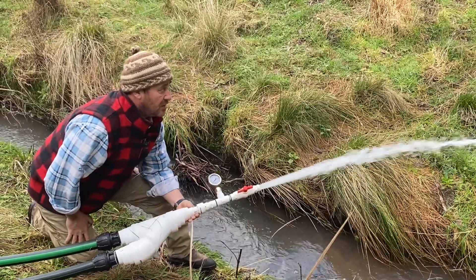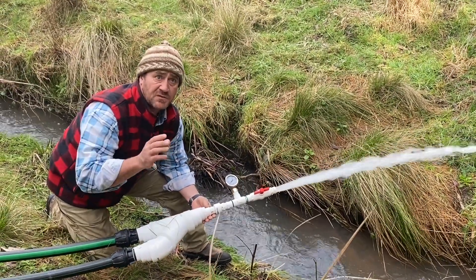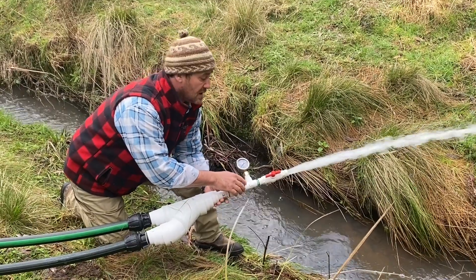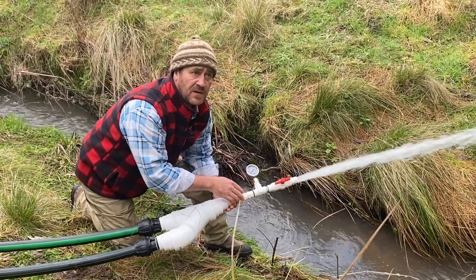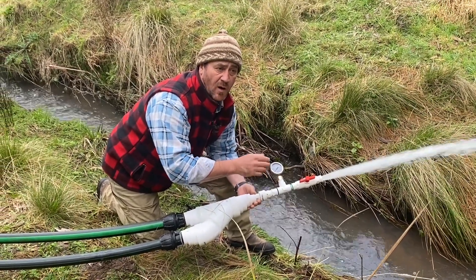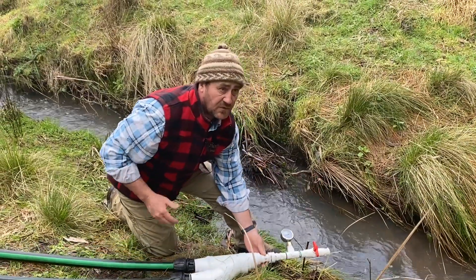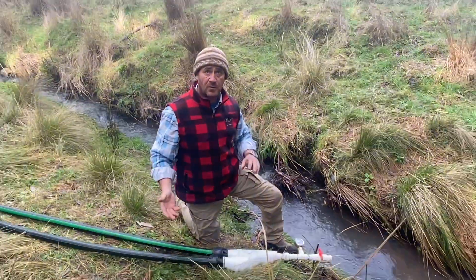You can see I've got my 90mm coming into this point here, and if I was to turn on this tap — you can see at that point there it's got good pressure, but that pressure is all based on resistance coming through the 90mm pipe out through a three-quarter inch outlet. I'm hoping that the system I want to look at has — I've got this little romantic notion towards a Pelton wheel or something of the sort, and that's really where I want to try and achieve to make the figures work.